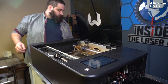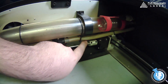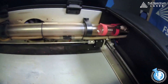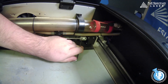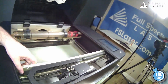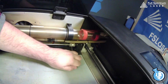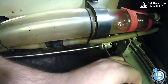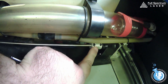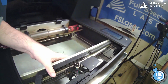Next, I'm going to grab my little camera again and show you what we're looking for. We're going to go down here below our tube and we're looking for this rod right here. This is the rod that makes the gantry on both sides move at the same time. These little screws right here - we need to loosen these. Now these are going to be pretty tight because these are holding this gantry rod in place. Once this is loose, you will be able to move either side independently of one another.